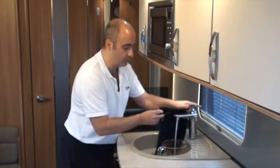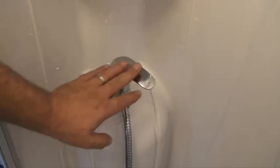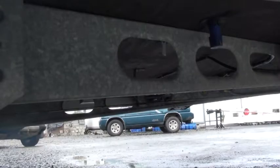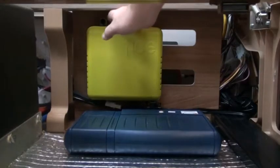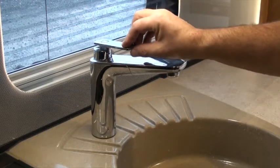There's no set order to the outlets you drain, but it does help to have a system in your head so you don't leave any out. I start with the kitchen sink for hot and cold, then the wash hand basin in the bathroom, the fresh water fed toilet, and then the shower. Then I open the dump valves on the water heater and the onboard water tank to see if there's anything left. To finish, drain any outside outlets if you have them. When completely finished, switch Flow off again and open all the outlets to let them breathe. Once you get used to this process, it should only take about 2 minutes.